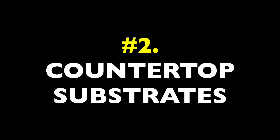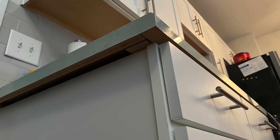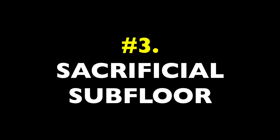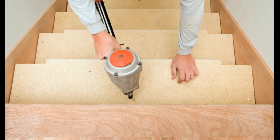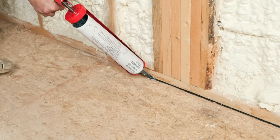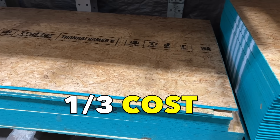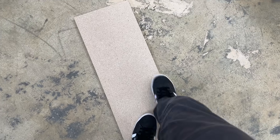Particle board is also used as a substrate for a lot of countertops, seen in residential kitchens everywhere. Shaping or making such countertops requires industrial-grade tools, so that's not a real DIY application, but you can repurpose countertops to great effect. Finally, particle board actually makes a decent sacrificial subfloor. Some people use it instead of more expensive underlayment like Advantech. Keep in mind, particle board subfloor is not code-worthy — it's too prone to moisture damage and deterioration, and no professional should be installing it. But it's drastically cheaper than better underlayments, about a third of the cost, so if you just need something stiff and fairly durable for a dry shop area, it can save you money and work pretty well for a while.